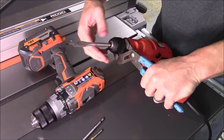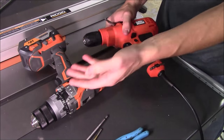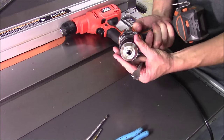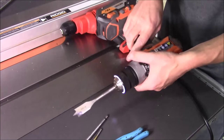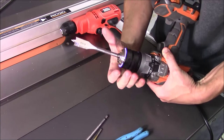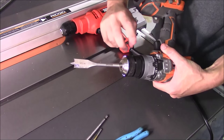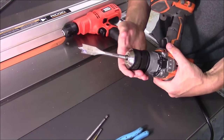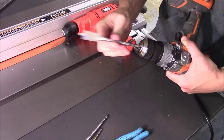This is really just one more step than you normally need to take, but do keep in mind that this is 30 bucks versus a couple hundred for the higher-end drill. Looking at a ratcheting chuck, you just spin the same bit down and then with one hand grab onto the chuck and listen for the ratcheting sound. It gets extremely tight and the motor doesn't need anything to hold it still. When you also want to break it free, you grab onto the chuck, twist it, it pops free, and you can remove the bit.